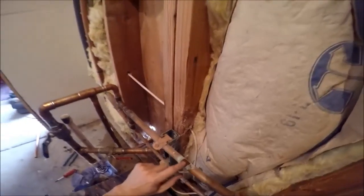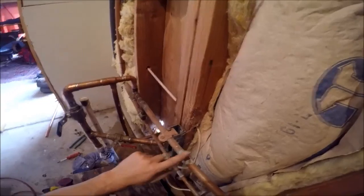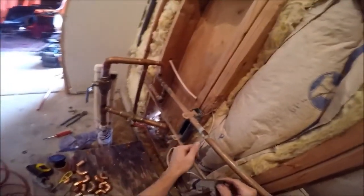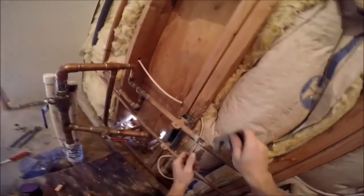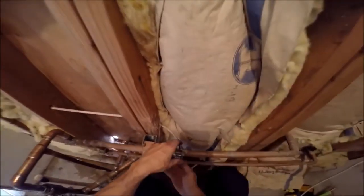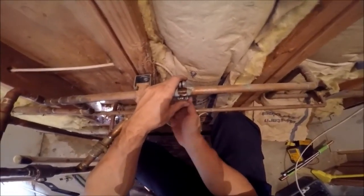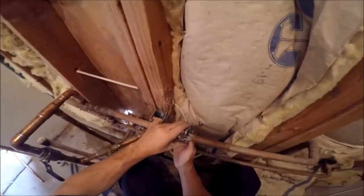Okay, well, that's cooling down. I took that saddle off. See how it just drills a hole in it? If I can clean it and it looks okay, I'll just cut it right there. If I got mobility, drain the water out and solder it. That's a perfect world. Sometimes you get lucky, sometimes you don't. Let's see where Murphy's at today.